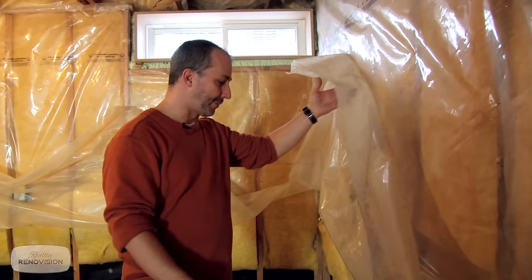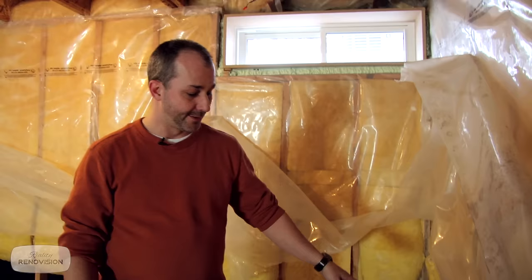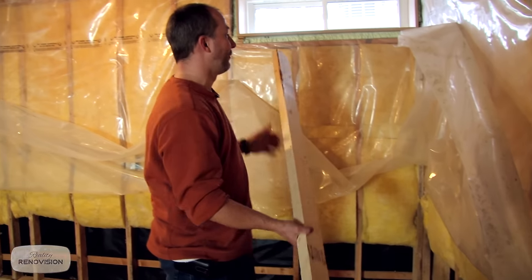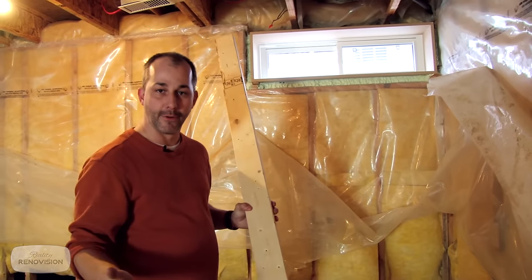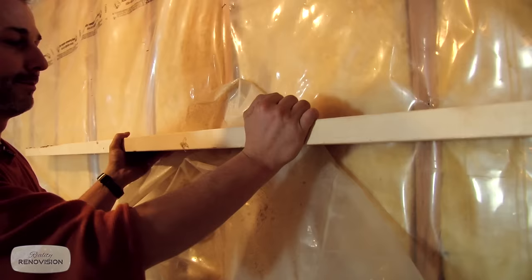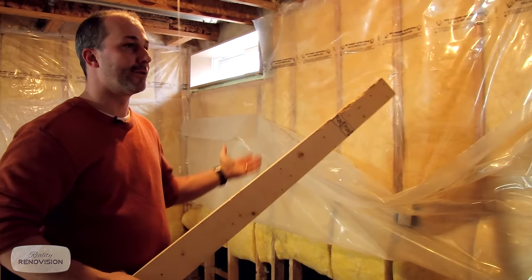We've just lifted up the plastic and tucked the insulation back under itself, in preparation for our electrician, to minimize how much time he has to be on site. That way he can just drill his holes and run his wires without hesitation. Because they used kiln-dry lumber the wall is still pretty straight. We'll go around with a proper straight-line level, identify beams that are warped or bent, cut and straighten them, throw in a shim and a screw, and then we're ready to drywall once the electrician is done.